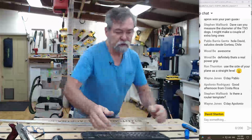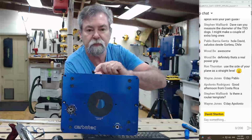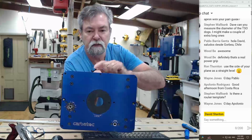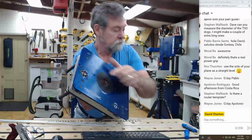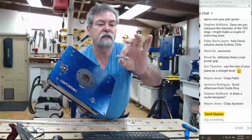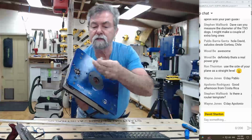Now on the lift, I did mention, it's got these little set screws. So just here, I don't know if you can see it, hold it steady, little set screws, and they're my adjusters to get the table level. And then here, I'm going to be putting these guys in. Now these also are another countersink. I think these are a 6mm countersink, maybe, yeah, 6 I think. So at M6, we'll go down through there.